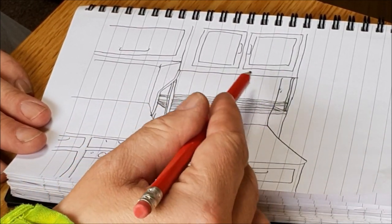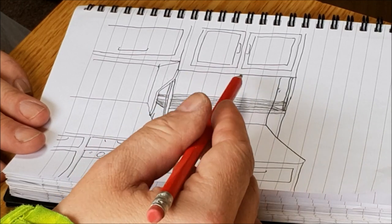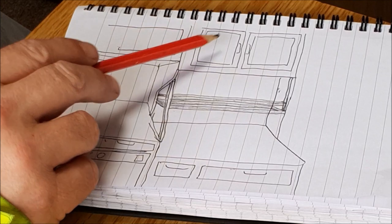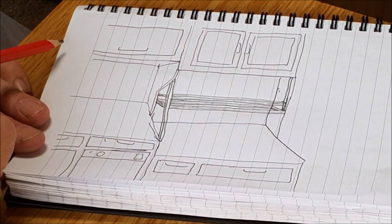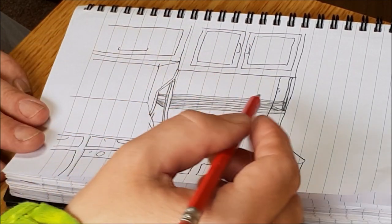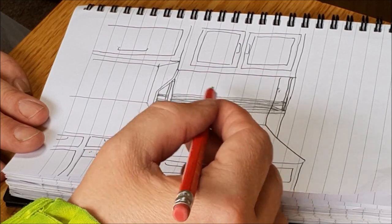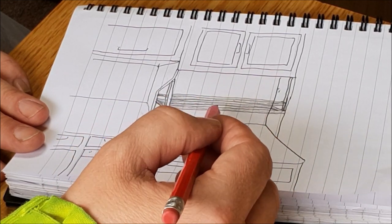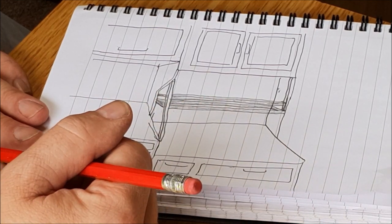Not so much fixings on here. This is just a thin sheet. There will be some battens in it somewhere, but I don't know exactly where they are. I looked in these cupboards to see if I could see any fixings, and I can't. So whilst I might be able to put a couple of screws through, they'll be really just to stop the shelf sagging and locate it rather than take any weight.